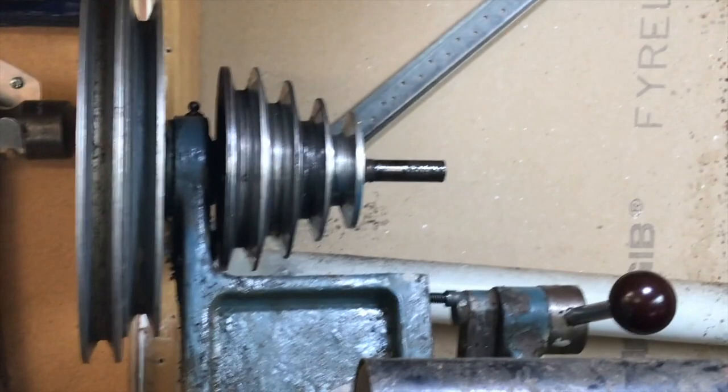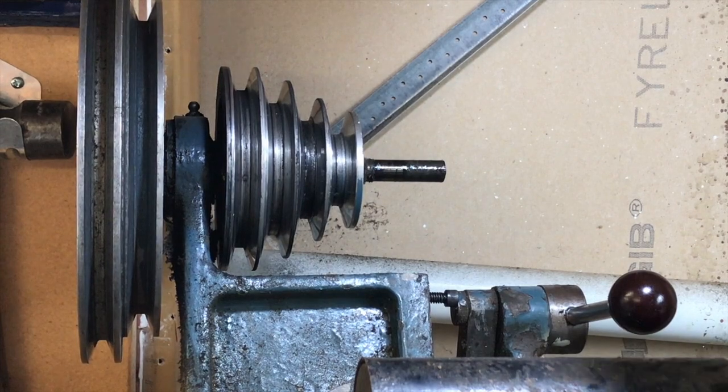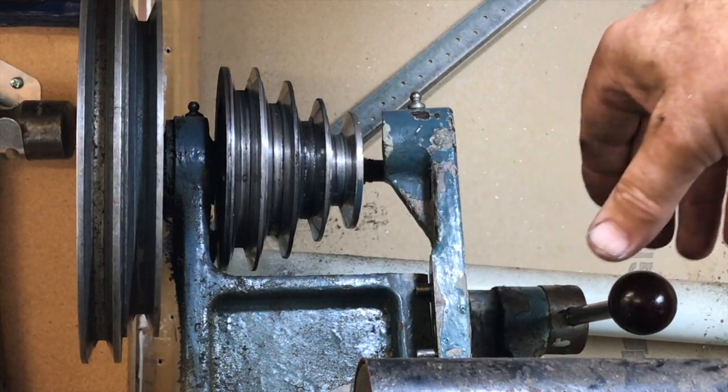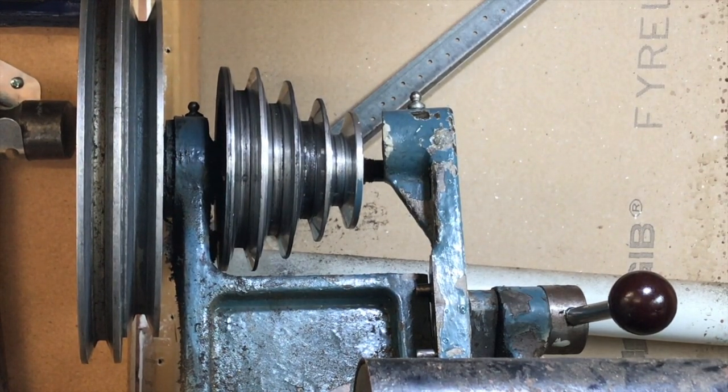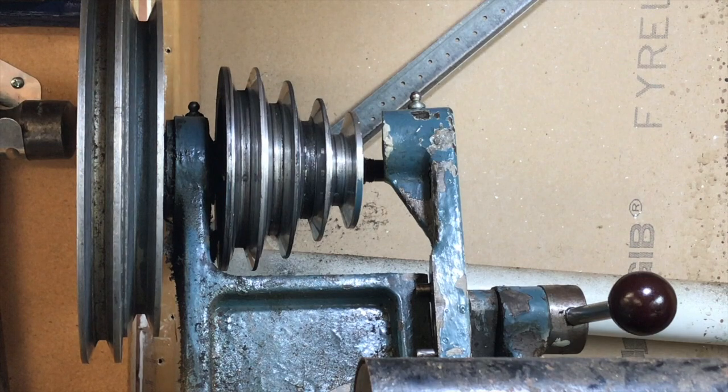Something good to know: I didn't realize until I took it apart that you can actually take the belt off. There's a device that goes on the end of the pulleys above the motor - a sort of idler shaft - and that has just two grub screws in the side you can remove with an Allen key. Unfortunately, the only way to get the belt out of the head is to completely dismantle it to get it over the spindle. You can buy special belts with links that you can take apart - that's what most people do. Otherwise, if you're using a standard V-belt, you have to dismantle the whole head to get the belt over the spindle.